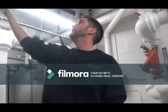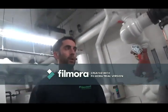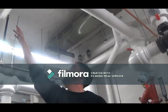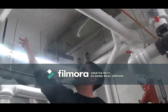So they're out in the parking areas. You can see it looks something like that fin and rad tube heater. That's what dissipates the heat out of those and warms up the floor so nobody's got cold floors, right? So you've got two separate loops, north and south, with one actuator for each one.